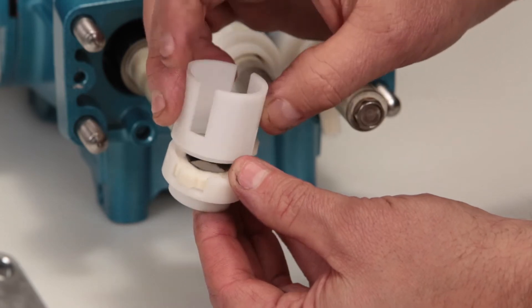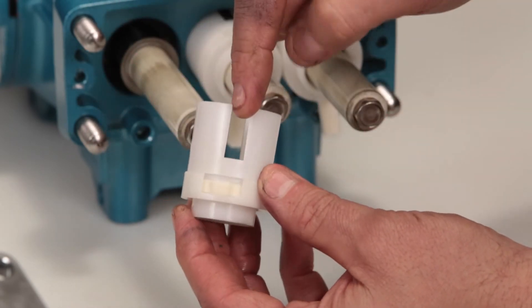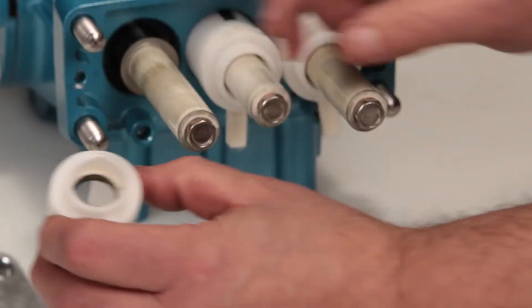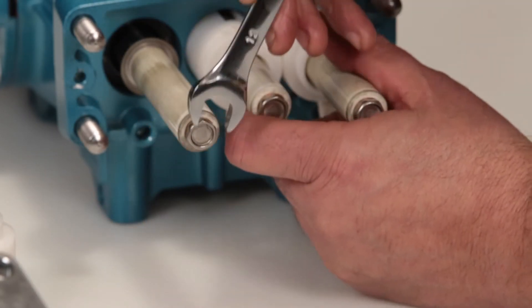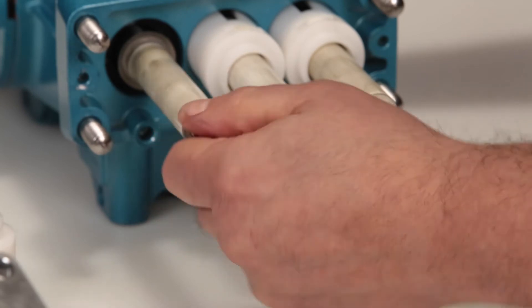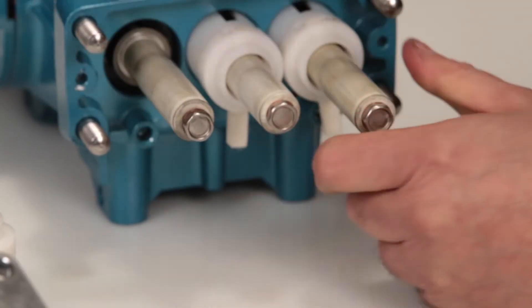The retainer can be snapped back together. Ensure the slots of the rear seal retainer are positioned vertically and the long tail of the wick is facing down. Using a 12mm wrench, loosen the plunger retainer. Before completely removing, stop and push the plunger toward the drive end to break it loose from the retainer.